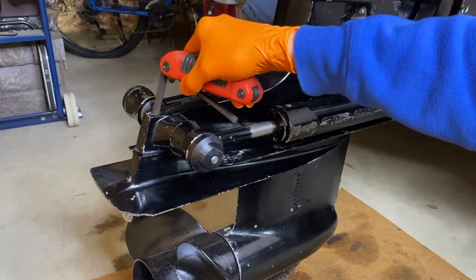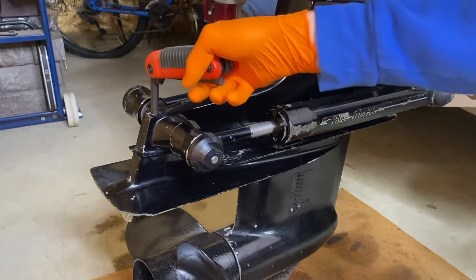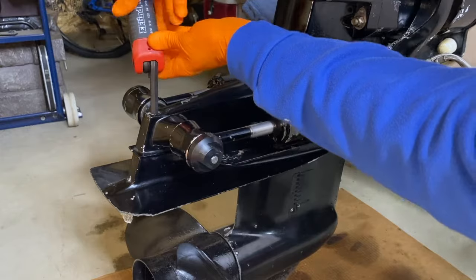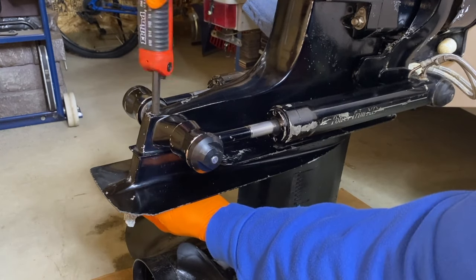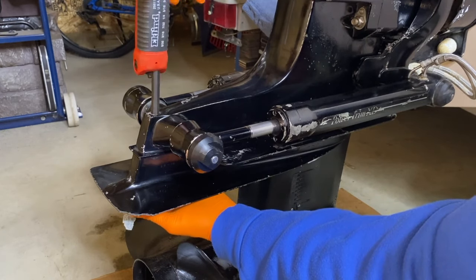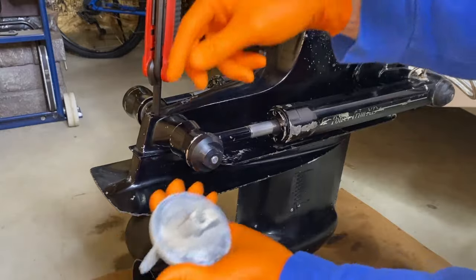It's kind of at an angle, but once you get it in, you can begin turning it. I am in and turning it counterclockwise to loosen it. Ours is already a bit loose because we just reinstalled the old one. What I recommend: come down below and grab the lower anode, and as you turn the bolt counterclockwise, the anode will begin to loosen and you can remove it. And there it is.